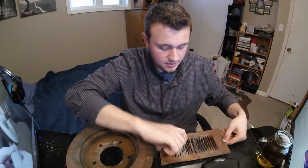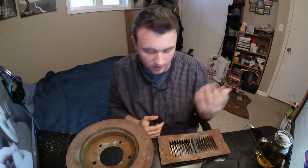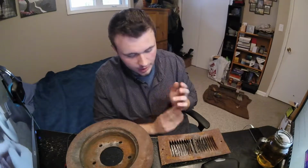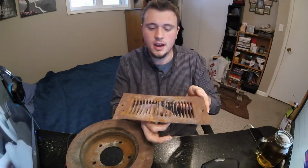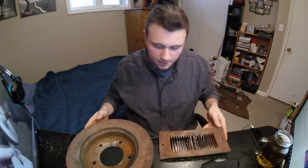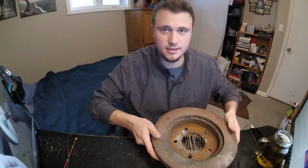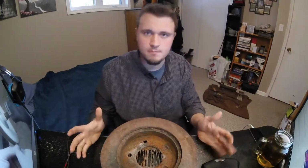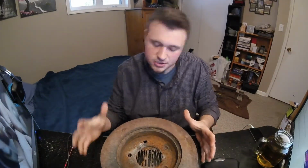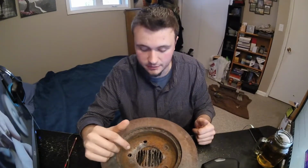Anyway, so this prevents any ash or large chunks of steel or coal or whatever it is you're burning from falling into a blower. So you have this set on top of an air source, a tube, and on top of this you have your disc brake. So it sits like this. Instead of an air vent, you could use any kind of mesh or screen that's pretty much preventing anything from falling down where you don't want stuff to fall down.